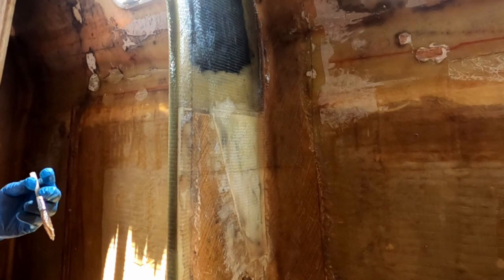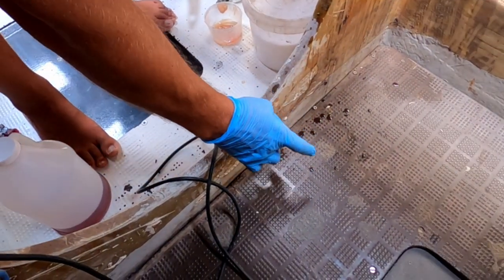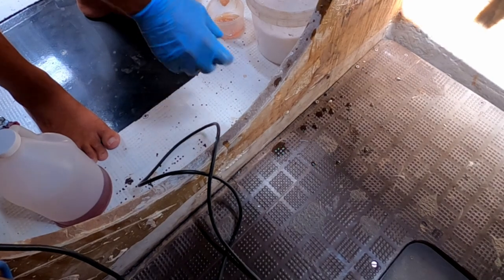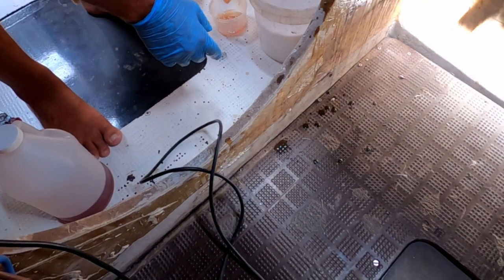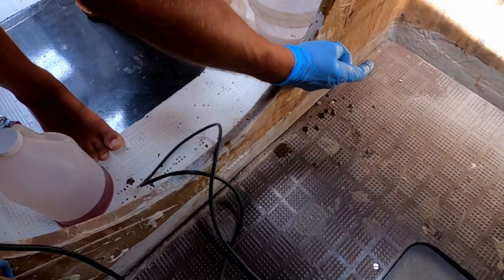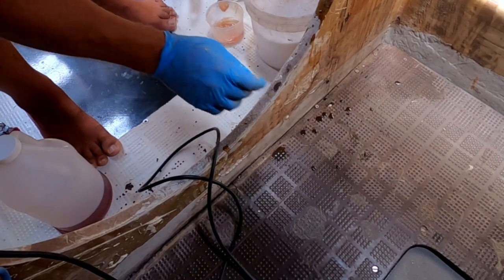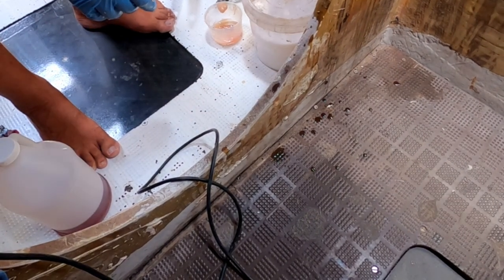And I think when Shane said it wasn't proper, it just wasn't very well laminated. There was a little bit of something, but it wasn't very well done. Yeah, some chop strand. You can still see it down here. That covers it, but it doesn't actually tie this skin to this skin. It just sits on the edge, so it actually has no structural purpose other than making sure the foam can't dent. Well, chop strand is never going to structurally tie anything together, is it? It's discontinuous fiber, isn't it? Yeah, but by doing it with a double bias, it's, you know, 10 times stronger.